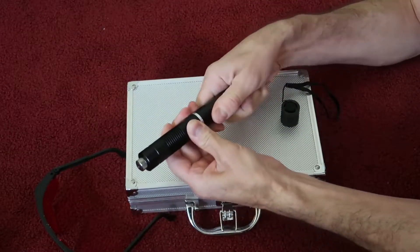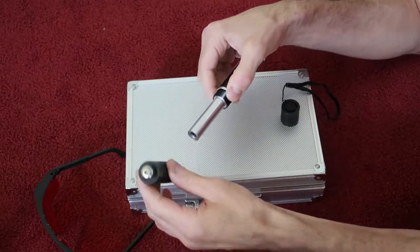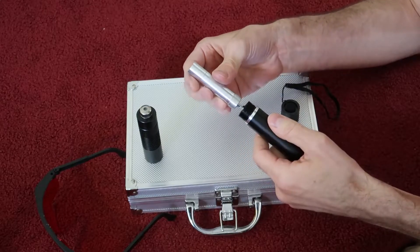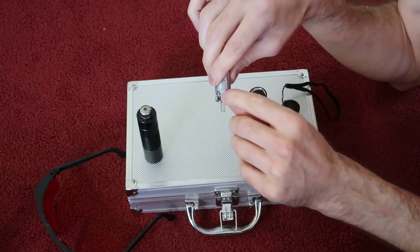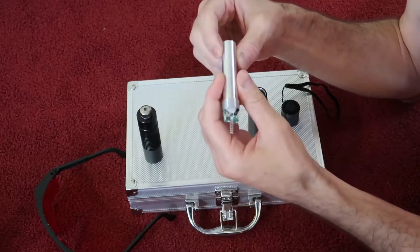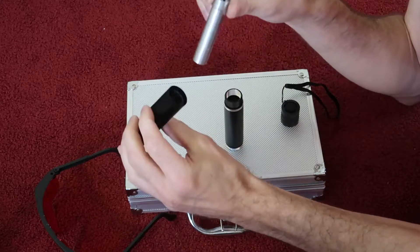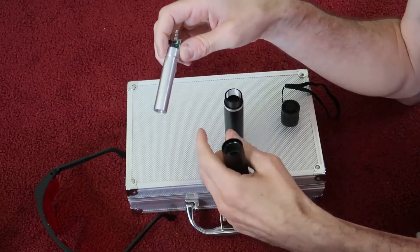While I have it apart, let's take the rest of the laser apart and look at the construction. This part unscrews and takes the whole front end off. There are a lot of threads, and there's a circuit board inside with a small trim pot that might allow me to adjust the power. I'm actually planning to turn the power down a little bit so the battery lasts longer and hopefully the laser lasts longer too. The construction is a bit odd — this part gets hot when the laser is on, but it's not in thermal contact with the outer piece.